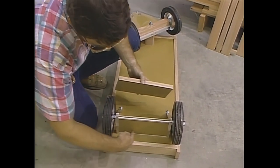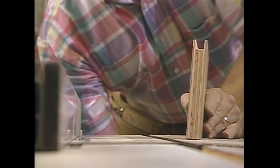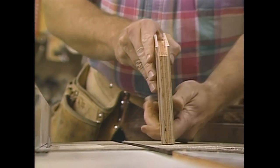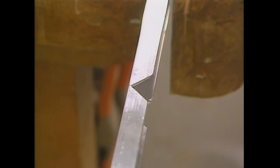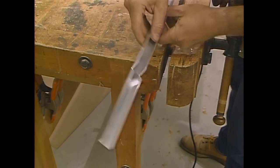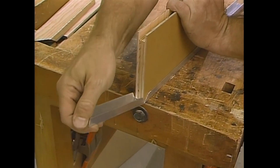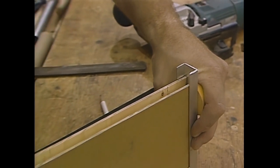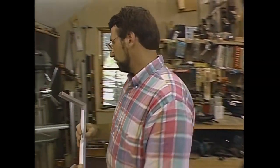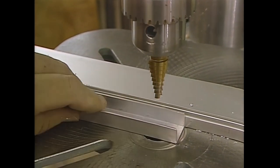The first piece for the rear suspension is this piece of plywood, which needs a dado cut in it to recess the axle. I didn't even bother setting up my dado head — just moved the fence once, that's all it took. Using my jigsaw with a metal cutting blade, I've made a 90-degree notch in this channel aluminum, and now I'm going to bend it around the piece of plywood. I've marked the dado, which is also the location of the axle on the channel. I need to drill a half-inch hole for the axle, so I've set up my step drill in the drill press — each step is a sixteenth of an inch bigger.